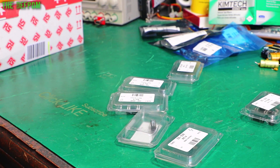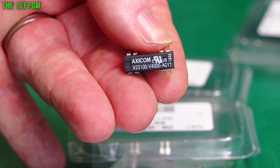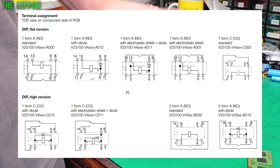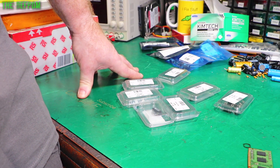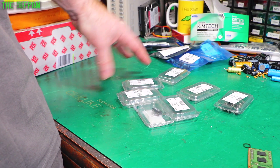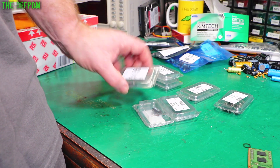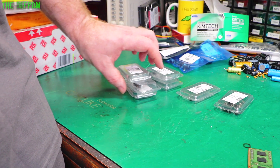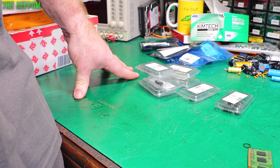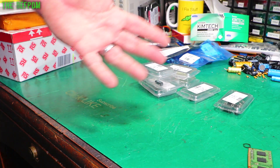Here's some more, which are individually packed - really they could have fit them all in one. Anyway, these are different ones: V23100-4005-A011. I don't actually remember what the functionality of these ones was. I bought different ones thinking I might need to potentially change other ones as well. I only know of one bad reed relay in the HP 8165A, but there might be others. So I looked at what other relays are in that unit and purchased ones which are also in it, just in case. At the very least, I'll have a stock of these in future, and a lot of the gear I work on does have relays, so having a stock of them is probably quite a good idea.